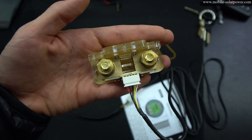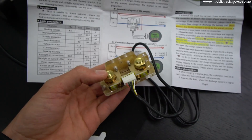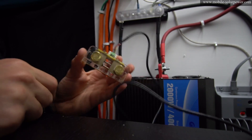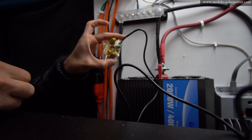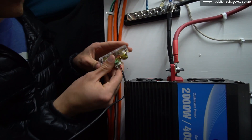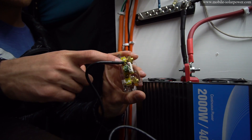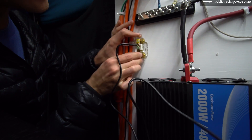There's an extra little cable you need to attach to provide power to the small terminals, and the large terminals are for the negative connection attached to the battery. Reading the instructions, it looks like we only need to provide one terminal with a positive power wire, which is not included — you need to provide your own tiny wire. I also noticed there's no adhesive backing on the mount despite it looking like there was, and no screws are provided. There's also directionality: the P goes to your loads or charging source, and the B goes to the battery cable.